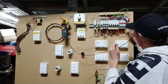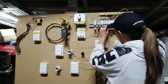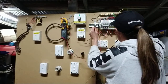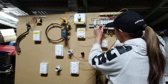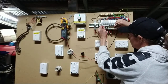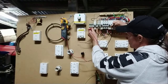Now you do the same for the actives — active to active, to the next one, to the next one. Don't forget L1, L2, L3 — you want to make sure that you haven't doubled up there somehow. Continue to the next circuit breaker, keep going through, test your tester — she's still working. Get to the next circuit breaker. Still looking pretty good.